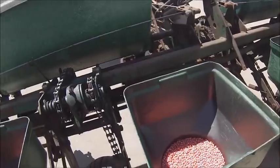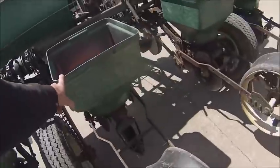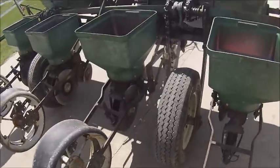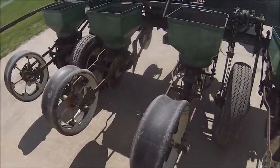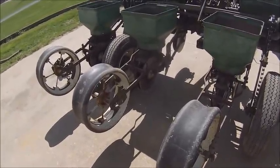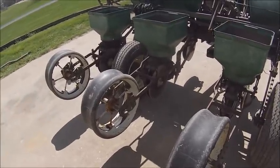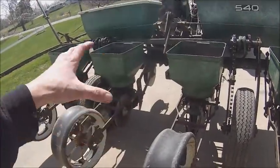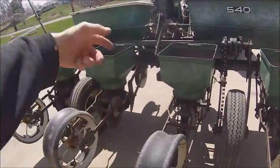The rounds came out at a 30 here, a 31 here, a 32 here, and a 31 here. You average all that out, it comes out to 31,000, which I think if I jump up to the next sprocket size, I'm probably going to jump over 32 and go to about 33, because the sprockets on this particular planter, I've found in the past, tend to be about 2,000 plant increments.